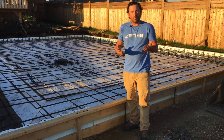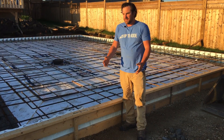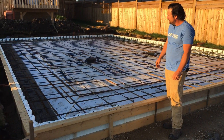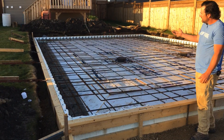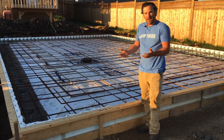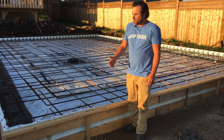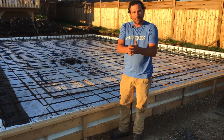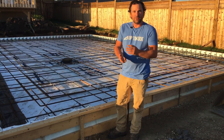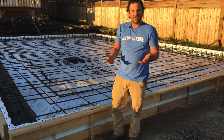On the drawings it shows a perfect level site — you just throw in some sheet foam against the concrete, backfill against it, you'll never see it. But in this case the grade work is actually 18 inches different from front to back on this 24 by 36 garage. Because my client is going to frame the garage himself, he doesn't have the tools and it takes way more effort. If we were to just shove sheet foam up against the concrete, how is he going to finish it on the areas that are exposed? With the ICF block it's bonded into the concrete, his wall will be flush with the foam block, and now he can attach siding or parging or anything he wants to the ICF block because of these snap ties. And we're also meeting the insulation requirements set by the engineer.